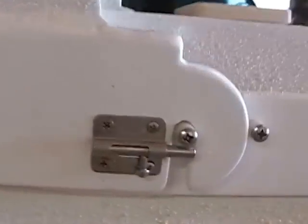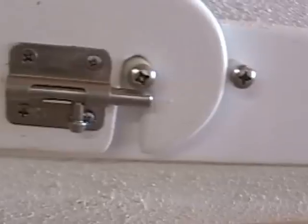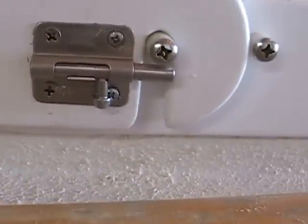I've got some more of those loops with these little hooks, and I've got another hold-down strap going across here to hold this down — that's pretty darn secure, and these will come off. I've got some stainless steel latches — I added an extra nylon bushing on there — and I've got these little stainless steel latches so that won't be flying off on me. Got my little hooks: the hook there runs through a pad eye to the other side, to another pad eye, and to the cam cleat — so that works pretty good, holds that hatch on really secure and comes off real quick.